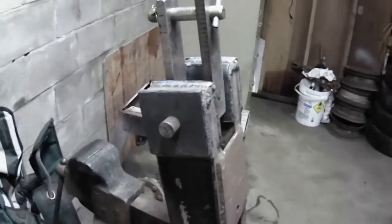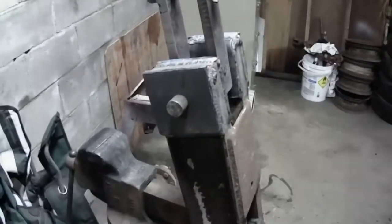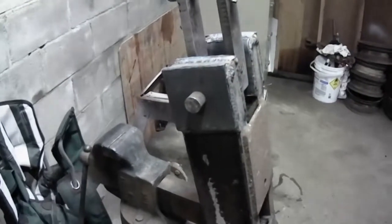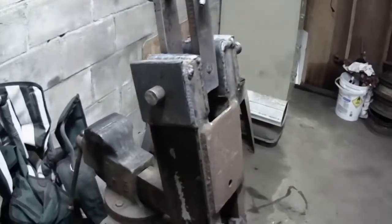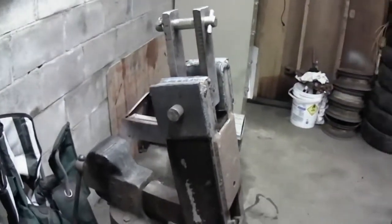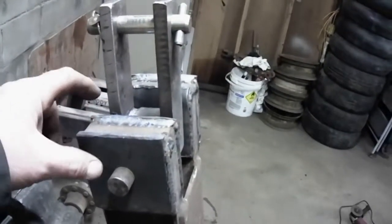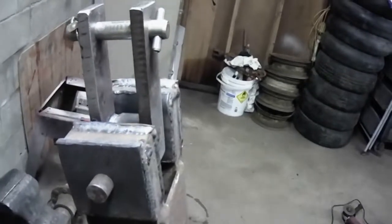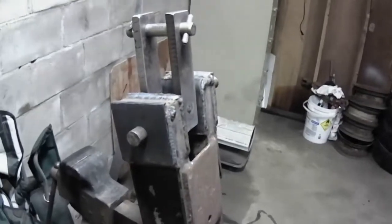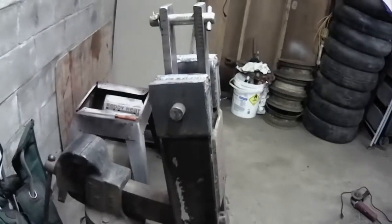All I've got to do now is drill the holes for the pin or get a bolt, one of the two. I'll just have to wait and see. I got to put the calipers on the bolt and see what the tolerance is. It could stand to be just a touch smaller, so it'll go in and out easier. But all in all, not too bad. Didn't draw up as bad as what I thought. When I went to bend these over, that's a 1/4 inch plate, but I think it distorted the holes. I should have left the pin in it with a hitch on it while I did that, but I couldn't really get a good swing on it.